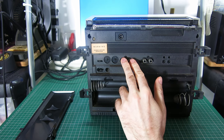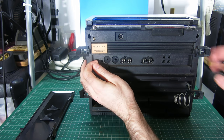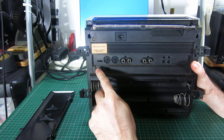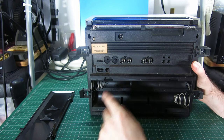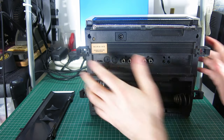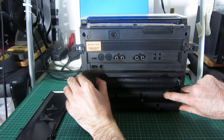On the back we've got an AUX input, an AUX output, loudspeaker jacks which are on two-pin DIN connectors, and RAF — that's probably a beat cut switch for recording from AM radio. We've got a mains input and a DC input which says 9–14 volts DC, so there must be a regulator. And two external mic inputs with holes at the top for the old mics with the remote start plug. No battery leakage or anything — those battery springs are enormous, like suspension springs.